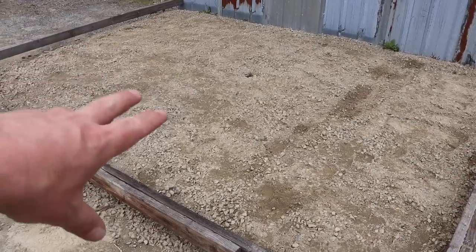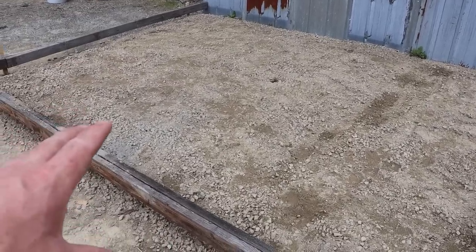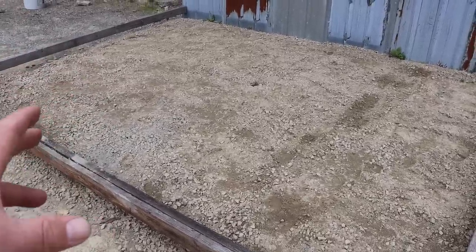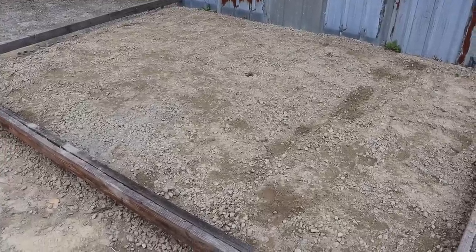We're aiming for about that four-inch mark on the slab. I've been wanting to get going on some concrete projects, but being that it's winter and we're just getting through the breakup here, we can't pour concrete all year round. We actually have to wait for not only the snow to melt and the ground to thaw, but it has to firm up. We're in a south view so we're a little earlier than other places. We still have road limits because there's still frost coming out of the ground. We tend to use this crushed rock base just for drainage purposes. We could put an insulation barrier underneath this slab - that would probably help a lot, because with the freeze-thaw we get here, if we get moisture underneath the slab it'll cause it to heave and crack. But there's a good likelihood we'll move the building in the near future, so I don't really want this to be super permanent.